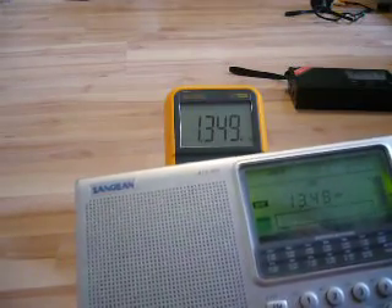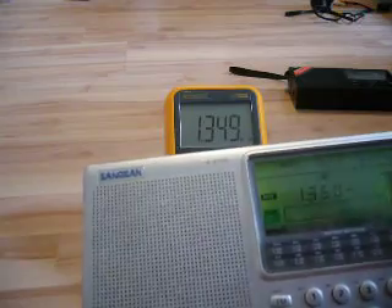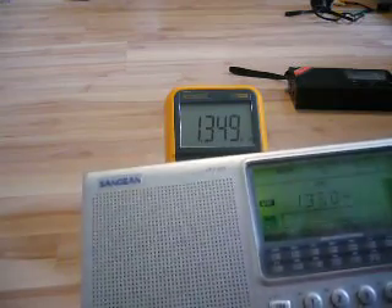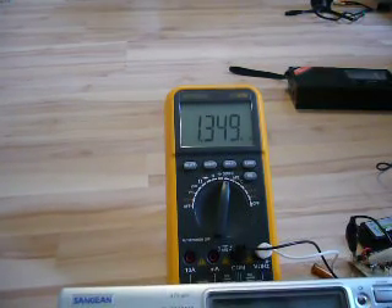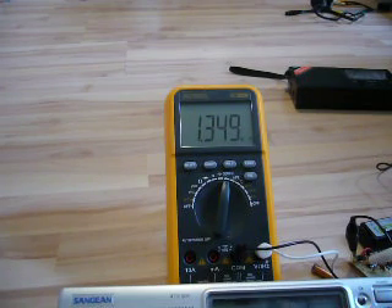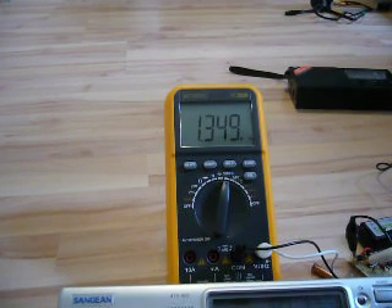Wrong frequency. So what I did is I added two transistors, as mentioned before. And when you modulate the timer chip on pin 5, you probably get frequency modulation. But on the AM band, amplitude modulation is used. So the sound is only good if you adjust the radio to the wrong frequency, because you get some kind of AM that way, I guess. With my transmitter we have amplitude modulation, and that's the modulation that is used in the AM band. And when you tune it to the exact frequency, you have good sound.